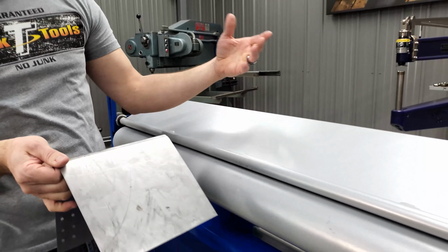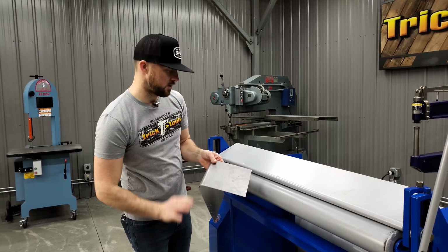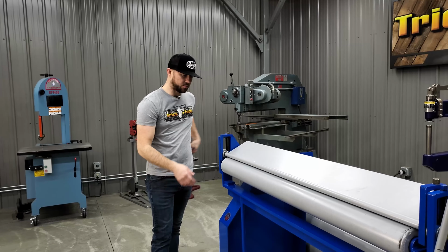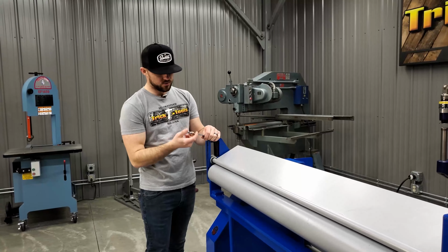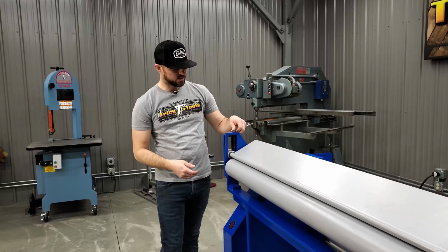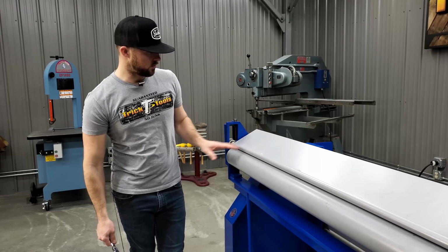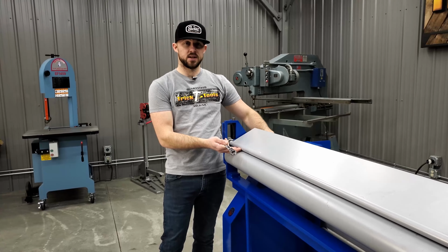And then accordingly, depending on which top roll you have in there and have it adjusted, you get those achieved dimensions as well. So for adjustments on this machine, once you get your top roll in place, you have an adjustment here. You just take your 5/8 wrench and you can adjust this roll up and down, and you can also use the second adjustment to adjust the bottom. You want to get the roll to where you can slide your material all the way through to the backside, make sure that's lined up properly,